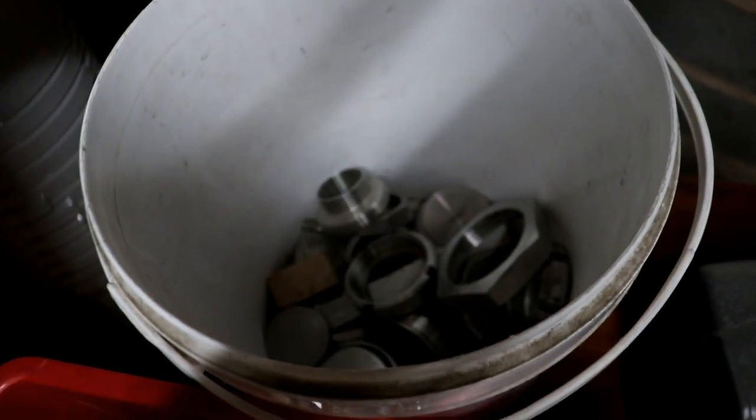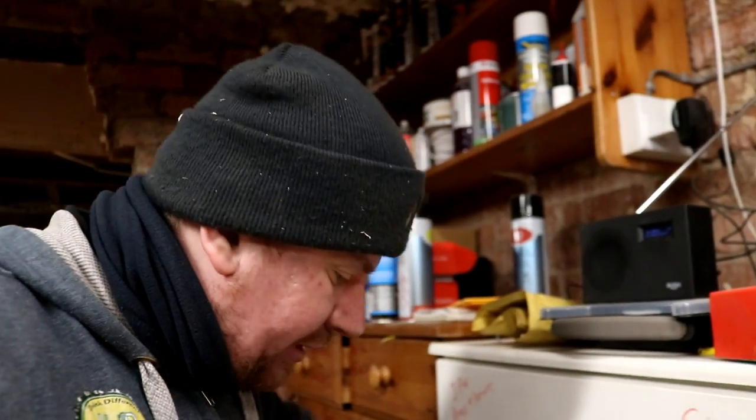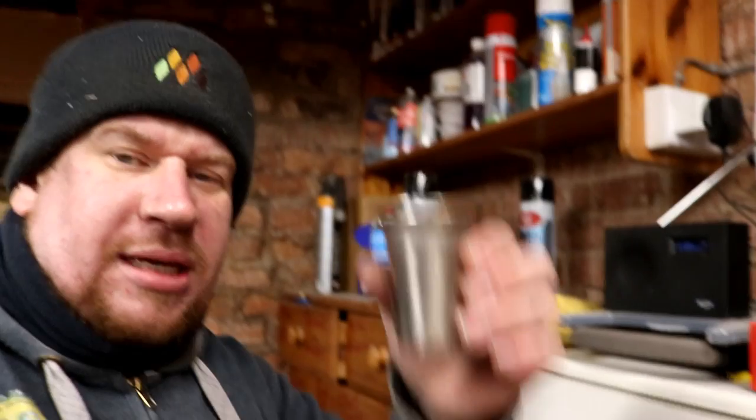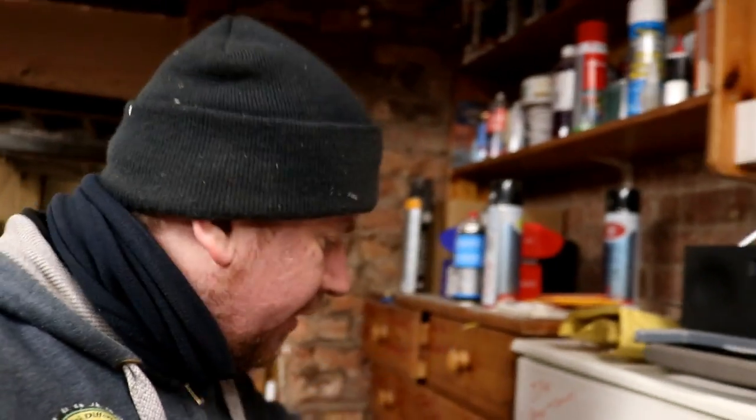So I think what I'm going to do is change that section down there, that is a 2-inch RJT fitting, and I'm going to dig around in my bucket of spares. Maybe not in there, but I'm thinking somewhere I've got an old 3-inch concentric reducer. So if I can sit a concentric reducer underneath, I don't have to bolt it together, but it'll be big enough for everything to drip into and let a bit of pressure out. So we'll see, that might work, it might not.